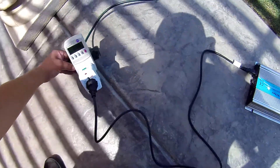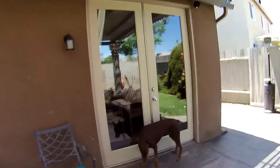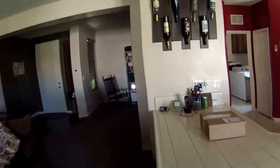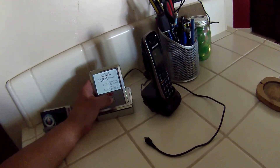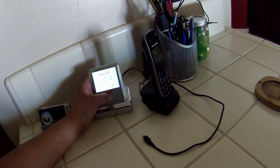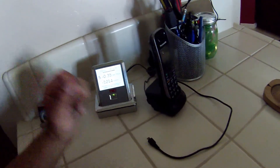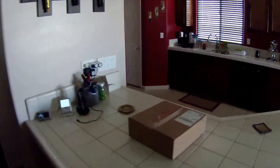We'll go ahead and look at the difference. We're getting about 60 watts now. We'll look at our TED 5000 and see what we're putting out right now. I have three MTUs hooked up to this thing — one's the grid tie, one's the solar, and one's the AC. Right now we're putting out 1018 watts back into the grid.